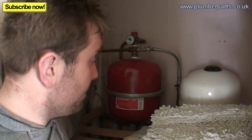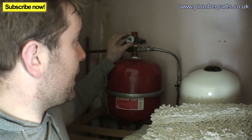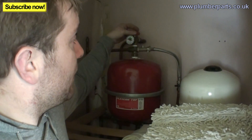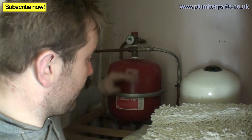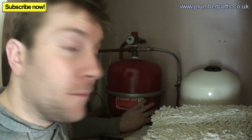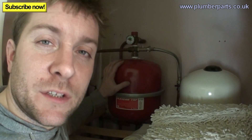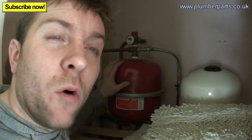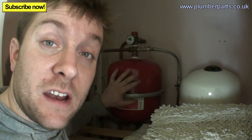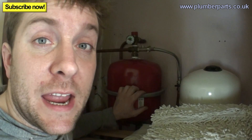Here's one on this heating system. Here we have our cold water main in, a check valve, our pressure gauge reading one bar at the moment because the system is off, our high pressure relief valve, and then our actual expansion vessel at the bottom. We've got water on one side, the diaphragm in there, and air on the bottom. This is a slightly smaller expansion vessel because you have to rate the size of the expansion vessel to the size of the heating system in litres. This system is really small, so there's not a lot of water to expand. But if you had a system with 20 radiators and loads of underfloor heating, you'd need a massive expansion vessel.